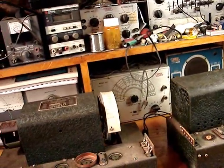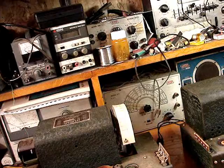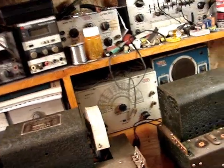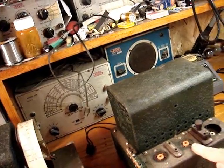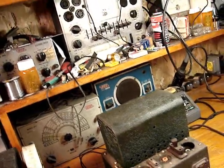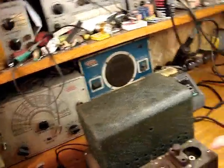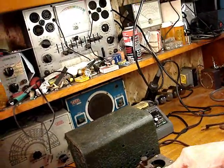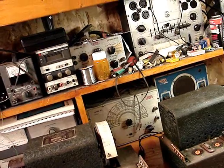This power supply section is pretty heavy; the tuning section is a bit lighter. I don't think I'll be running this up voltage-wise at this stage — I'm going to do some electrical tests with my meter first. I'll need to see if I can get a pair of 171A tubes; I don't think number 26 tubes are appropriate substitutes — that'll take some research. The number 80 rectifier goes here. So here's the radio all apart, and I'll do some further electrical investigation.